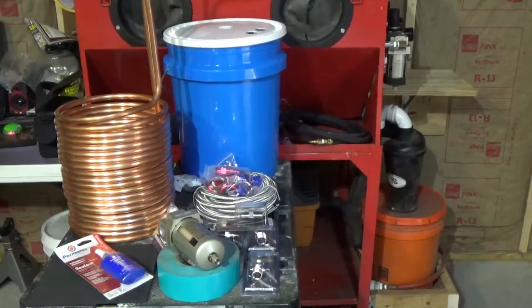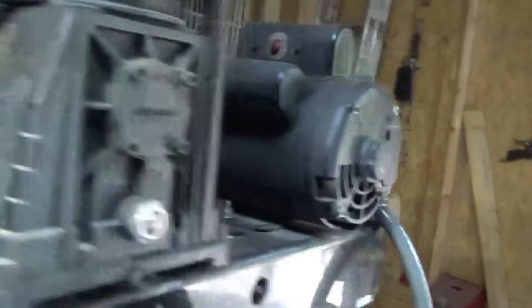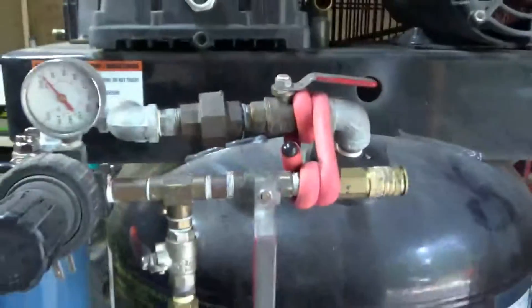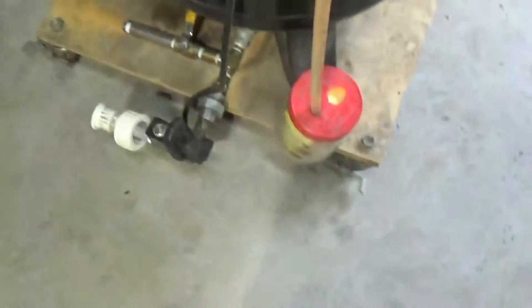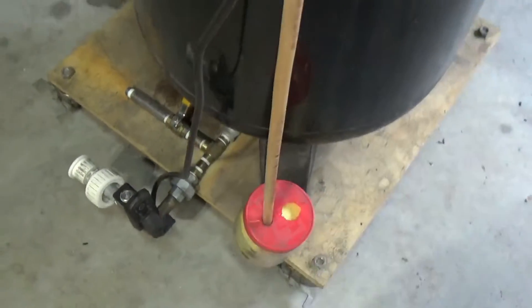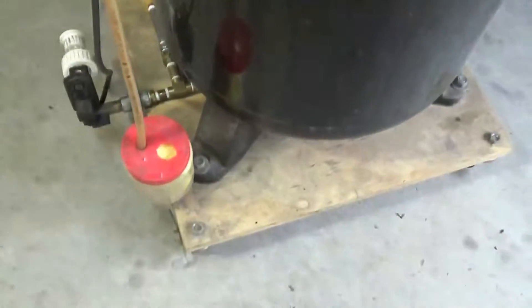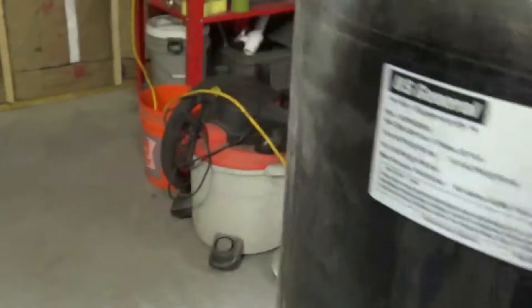There's been a lot of moisture in the compressor lines. I had multiple separators and I already have a two-stage compressor — this Harbor Freight two-stage — which generally runs good. It's just been so humid. The water filling has been intense. I have an automatic drain valve on the base that goes off every 45 minutes, and then I have another big water separator that I drain into a jar with a sponge every now and then.